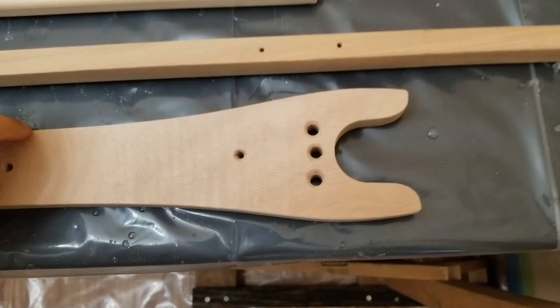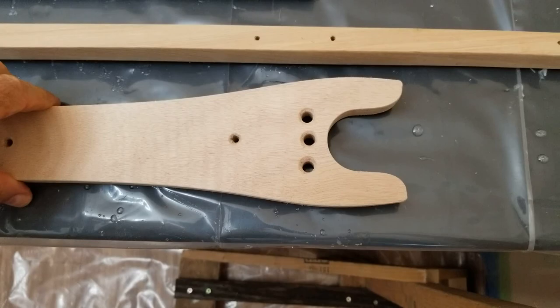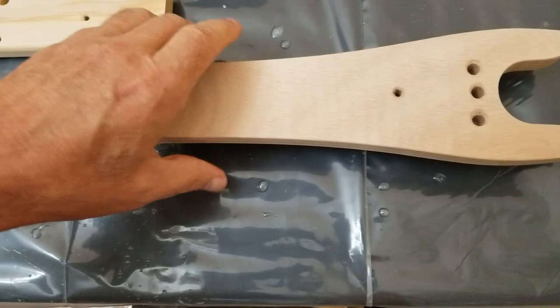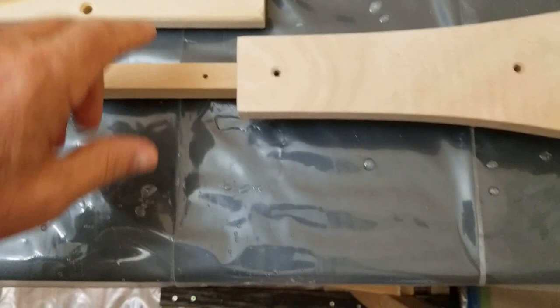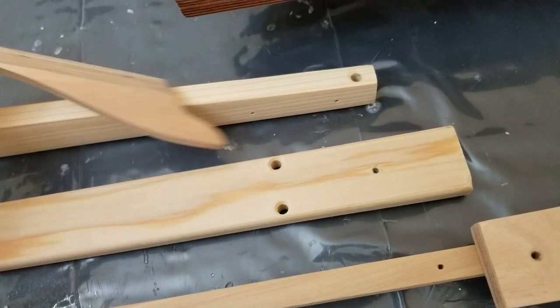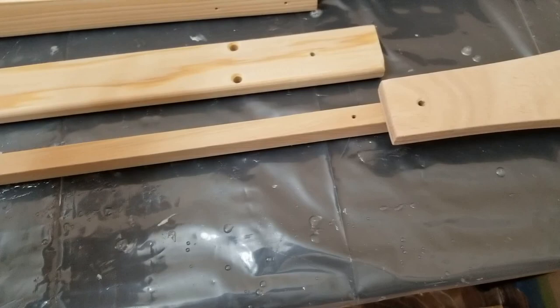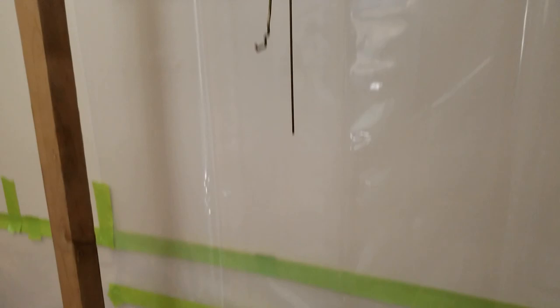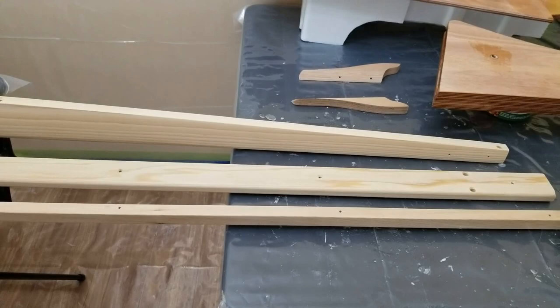My plan is this is a pretty big glue-up, where I've got to do this whole thing with thickened epoxy. The boom gets put up on top here and then screwed down. I'll put this one here first and then use the long piece to help me find the location easier. On the yard, we've got these yard jaw pieces that'll fit out here — I'll do those after I do the big glue-up here. There'll be plenty of squeeze-out and clean up, so this could be kind of messy.